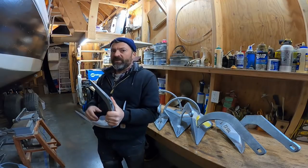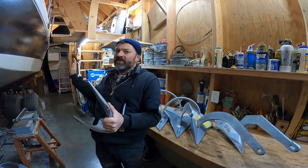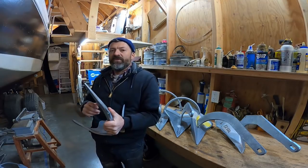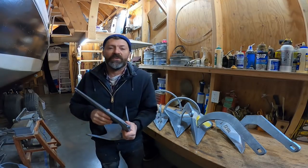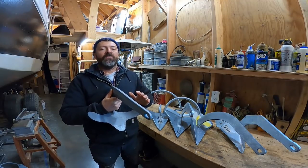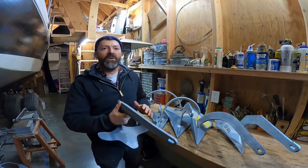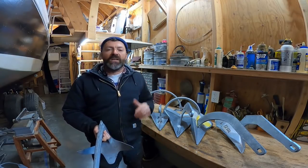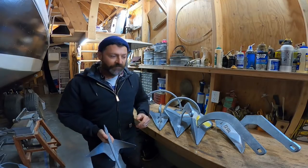At the end of 180 degrees, I straighten out the engine, the boat stops moving, and then I increase thrust up to either the boat's maximum thrust or the maximum holding power of the anchor. If an anchor fails to produce significant holding power in the straight line portion, I just discontinue. If it just can't do it, I don't bother trying.